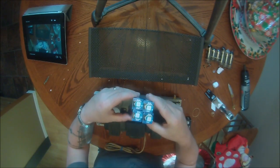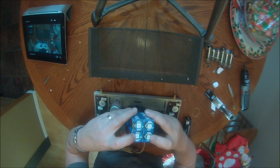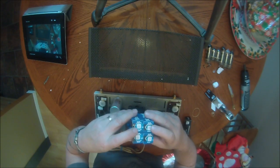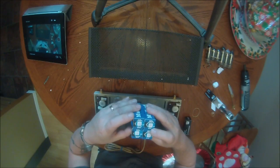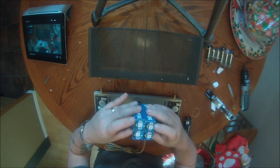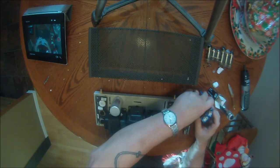But anyway, you can see the ends. They've been tested and they have a 50. All four of them say 50 there. So I think that's the voltage for the plate. I'm not sure, but it shows a current. All of them have the same, they put out the same amount. They matched all four so that my output tubes are outputting the same amount of power, so the left and right channels sound the same. One isn't louder than the other. Sometimes you can match tubes, and they give you a couple of specifications, so they show you the IP and something else. But here they just show that they're all 50s, so that makes a quad set and they're matched. So I'll put those tubes in.